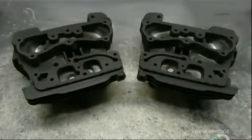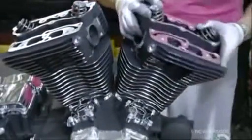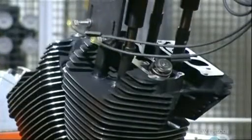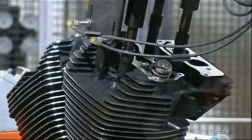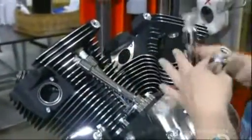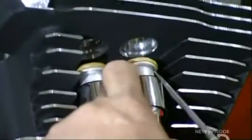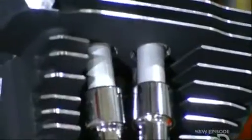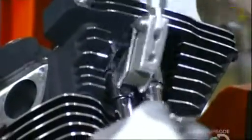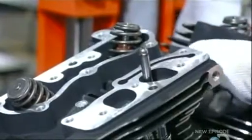These are the cylinder head castings. Technicians paint them and then machine them to fit on the cylinders. A robot bolts them together with just the right amount of torque. The operator then installs tubing that will house push rods, snaps them into the cylinder heads, clips on metal covers to secure them, and inserts the push rods in the tubing.